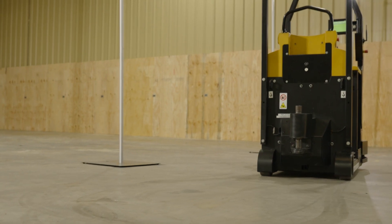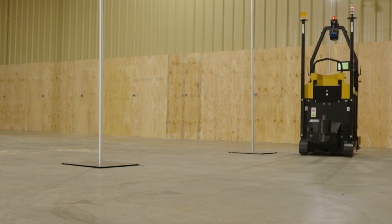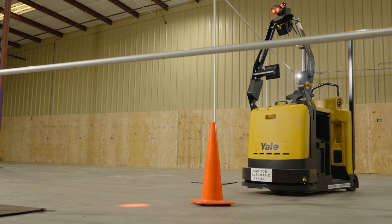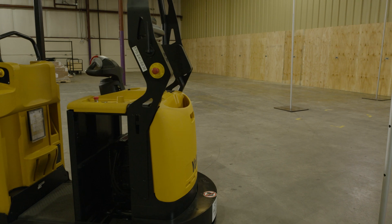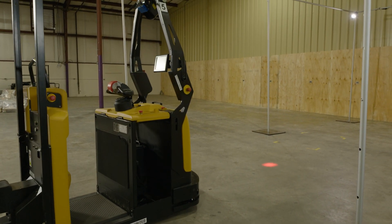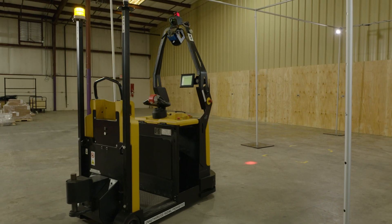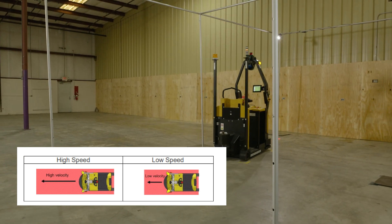The length of the field monitored by these laser scanners varies in accordance with the robot speed. When the robot is in automatic mode, intrusion of an obstacle in the field disconnects power to all the original truck modules and activates the brake. The dimension of the field monitored by these scanners depends on the installation environment. The detection field is designed to cover the width of the tractor and the trailer. The length of the detection field adapts to the speed of the robot.